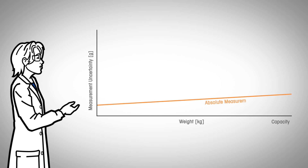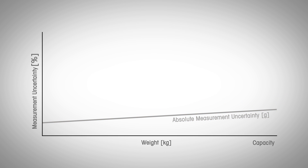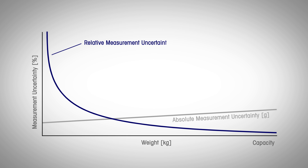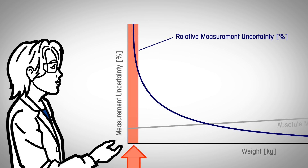Finally, let's look at how to interpret calibration results and turn this information into profit. Any weighing device, be it a micro-balance or a 5-ton floor scale, shows the following behavior of measurement uncertainty. The absolute uncertainty in milligrams, grams, or kilograms increases as you place more weight on a scale. However, the relative uncertainty — which is the absolute uncertainty divided by the weight — increases with smaller weights. On the lower end of the weighing range, the uncertainty is so high that you cannot trust the weighing results. Would you accept material weighed with an uncertainty of plus or minus 10, 50, or 100%?